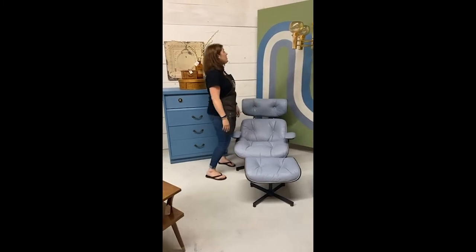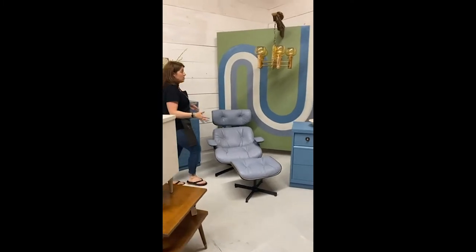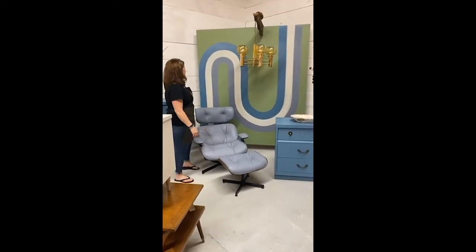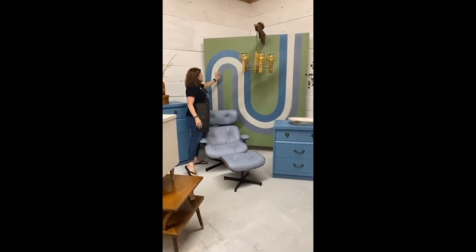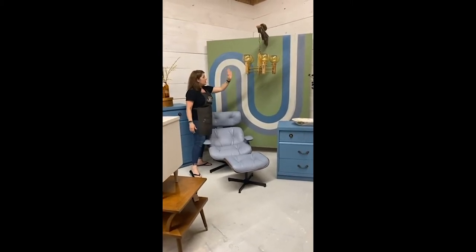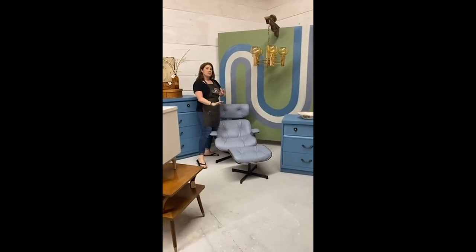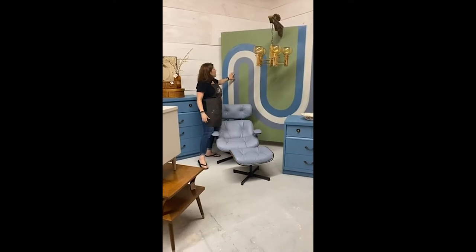Love it. The wall on the back was a wood wall, so nothing, not treated or anything like that. And Miss Lori designed our swoosh and painted it with Luckett's Green, French enamel, grain sack, and dried lavender. So we painted the whole entire wall, and then Lori came back and did the colors. And then we actually sealed it with hemp oil. Hemp oil brightens those colors up. It was kind of drab and dingy. And then when you add that hemp oil, it really brings those colors out. So that's what we did on our wall.